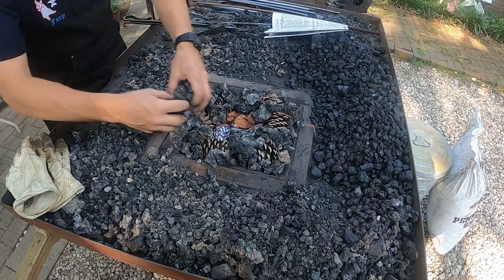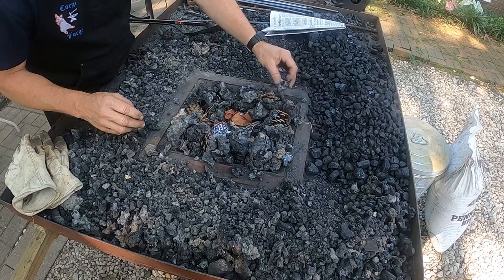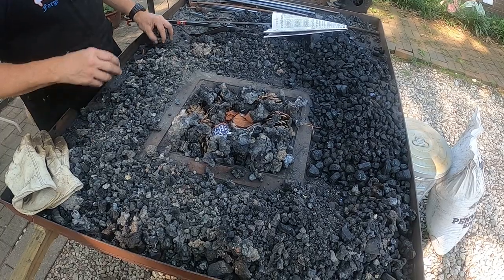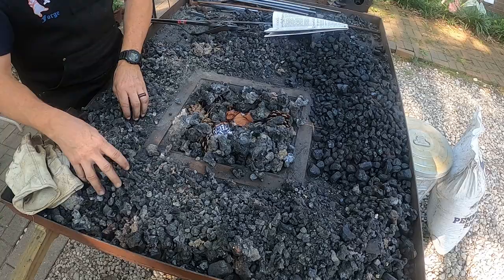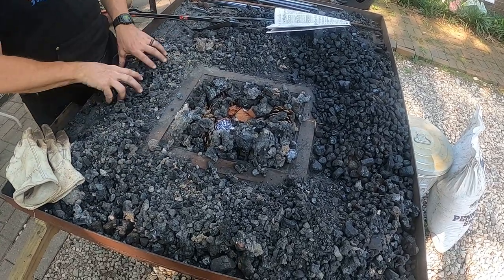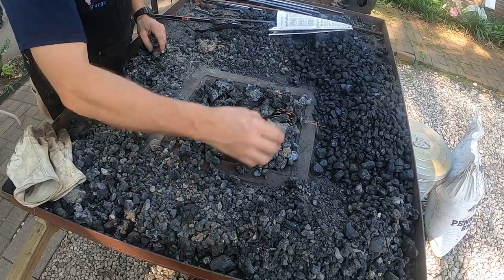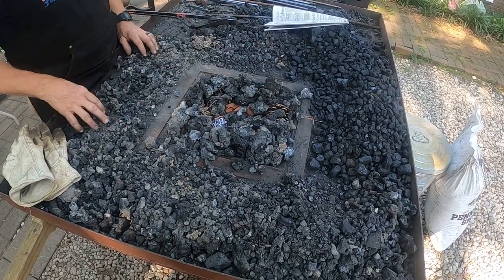Having never used just the pure coke as a fuel, I guess it would probably be an easier fire to maintain because you're not worried about converting coal into coke as part of the process. You're basically just raking in pure, clean burning fuel into the fire. You really wouldn't have to worry about too many clinkers at that point. Yeah, exactly, because it's basically purified. It's turned into pure carbon.